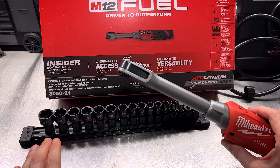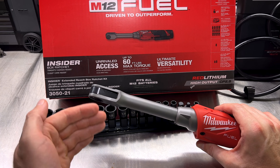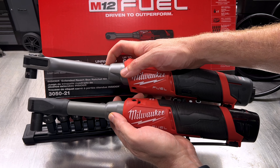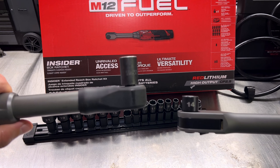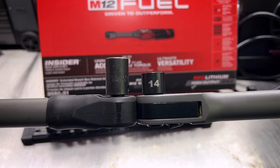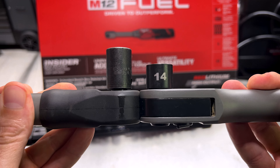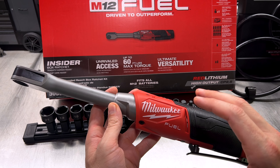They are not focused on the pass-through part — it's merely about compact overall size. To show that off, I'll grab a regular long-reach Milwaukee and put a traditional socket on it for a size comparison. One quick thing: these have a longer reach than the traditional long-reach ratchets. The high-speed long-reach has a longer neck and can get into deeper areas. But here's the main selling feature — we've got a 14mm shallow on the high-speed 3/8-inch drive, and we've got the 14mm on the Insider, and you can see just how much space savings you get with the Insider versus a traditional ratchet and shallow socket.